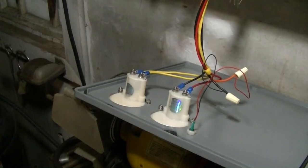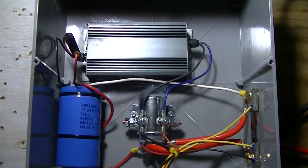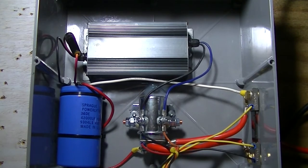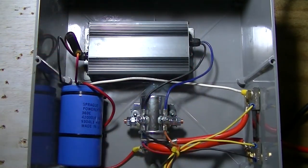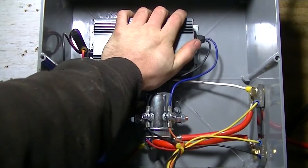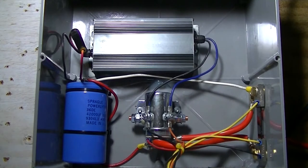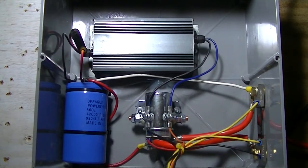I got this big box so I could put everything inside and keep it clean — it looks a lot better, everything's contained. I've got nice long leads on all this so I can take the lid off and rest it right here on the grinder to show you what's going on. That voltage reducer will never get hot — it's ice cold. If summertime gets here and I notice it getting warmer than I'm comfortable with, I'll throw a fan on there, hook it up to the relay so when the relay kicks on it turns the fan on and exhausts it. I'll put an air filter and mesh screen on the bottom with the fan on top to suck the heat out — simple.